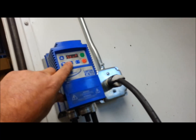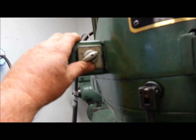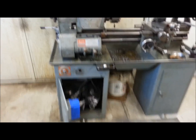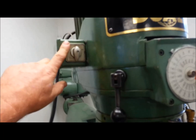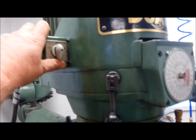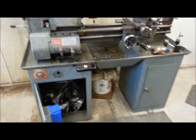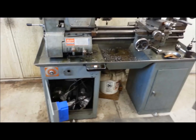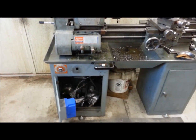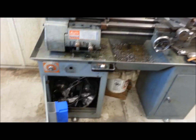P100 input value 1, Enter is your remote source, and your remote source is either going to be maintained contact — like on the lathe with the old drum switch — or momentary contact. On the lathe I'm just running a small building cable with two conductors to one pole of the three available poles in the factory drum switch to operate the VFD. Same setup on the other machines: just run two conductors over to the switch. That one is programmed to use a speed reference — a programmable parameter — and the speed reference is a 10k pot, that little potentiometer on the dial. That's maintained contact.